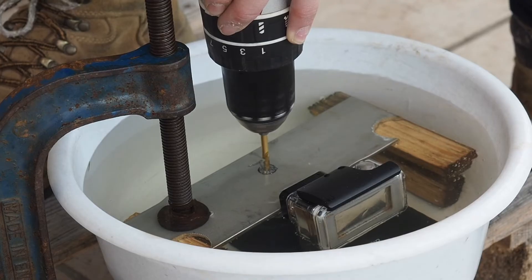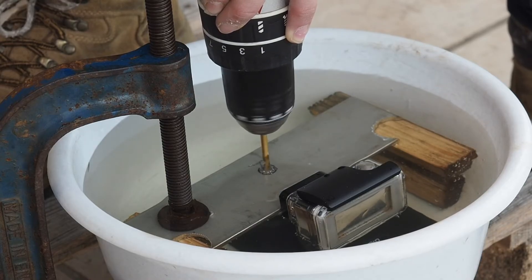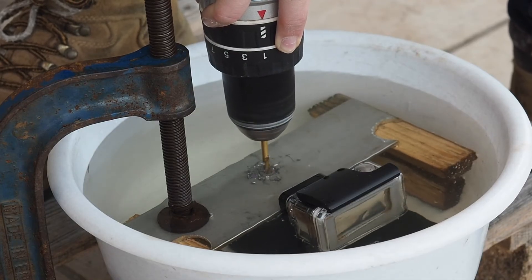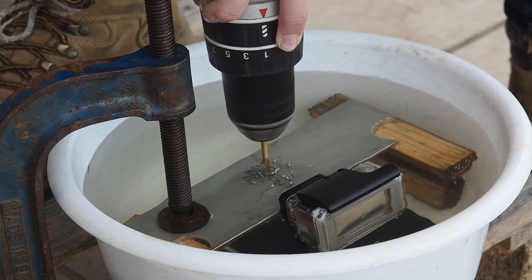As you can see, you do need to be a lot more patient drilling metal than when you're drilling wood, as it does take a lot longer to break through. You do need to apply quite a lot of downward force when drilling metal, and you should be able to judge that on the behaviour of the drill — if it's jerking or creating too much noise then you probably need to change up what you're doing. It is important that when you can feel you're about to break through the bar, you slow down to about 35-40% speed, as the metal is at its thinnest point and therefore can't dissipate the heat throughout itself very well. So if you continue at a faster speed it will build up heat and it can blunt your drill bit. This step is more crucial when you're drilling thicker materials, but still try to slow down if you can every time you drill a hole.